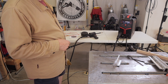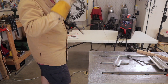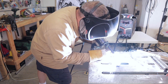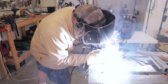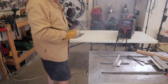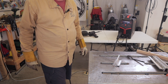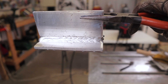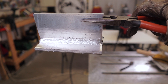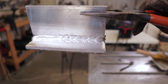I'm going to bump it up to 24 volts — so 24 volts, 14.5 on the meters per minute. That was better. I could probably stand to go up maybe half a volt more. It's not a bad looking weld — a little bit of spatter, and I think I could have gone to 25 volts. But with some practice and adjustments on those settings, I think it does a pretty nice job with the YesWelder YWM-200 in conjunction with the YesWelder spool gun. Pretty nice little combo.